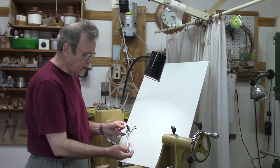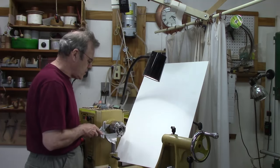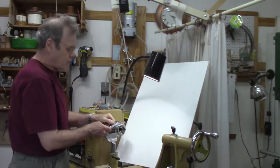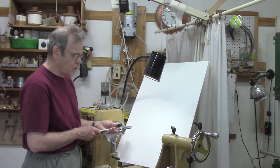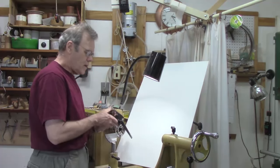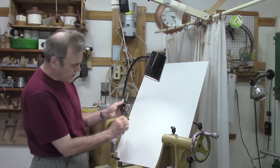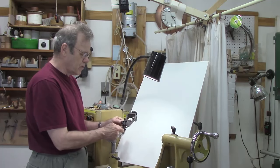I don't think I've shown this before. This is a slick lock nut wrench — very inexpensive, not high quality, but it came with a wing nut. This is great for removing chucks, spindles, and a variety of different things because you can adjust it. The problem was that wing nut was very difficult to tighten and loosen, so I replaced it with a one-quarter by 20 plastic knob from a woodturning store — the kind you use for jigs and fixtures. While I was at it, I put the same type of knob, a little larger one, on my Vari-grind jig instead of the wing nut, which makes it a lot easier to adjust. I've actually got a hole drilled where I can sight through it to line it up, but if you do adjust it a lot, trust me, a plastic knob sure makes it a lot easier.